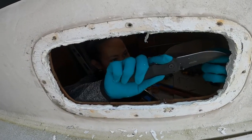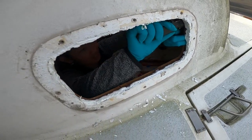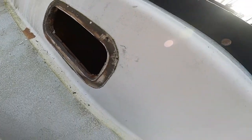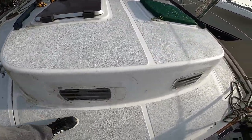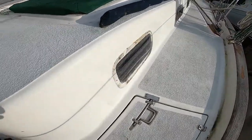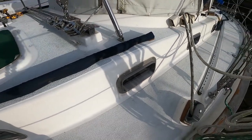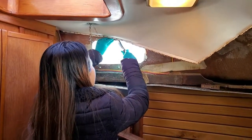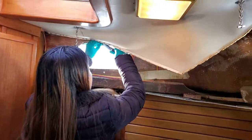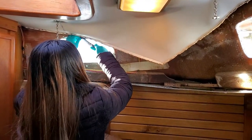What do we got going on here? Helping out, baby? Good job. Yeah, so we got that port light out, and then the two back ones. We got another one — we got those out from another time. And we got this one out today also. That one's to the bathroom, so we're not going to pull that one today. What she's doing right there is trimming all the excess 5200 seal that's around all the port light cutouts. After she's done with that, I'm going to go around it and add fiberglass layers on the inside to thicken up the structure around where the screw holes are.